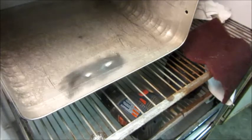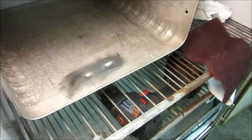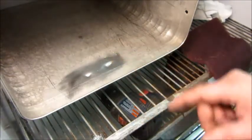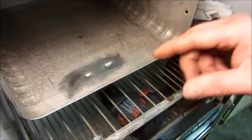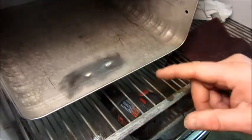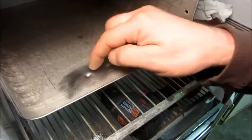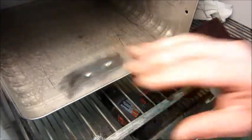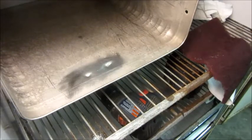Now I'm going to turn the nitrogen back off and figure out the best approach. Those gouges aren't wide enough open that I think it justifies putting a big patch over them, so I'm going to use Stay-Brite solder and fill in the divots. That should be a good repair — at least that's what I'm hoping.